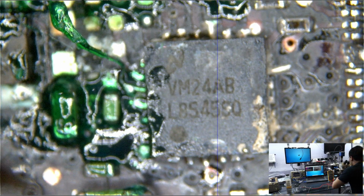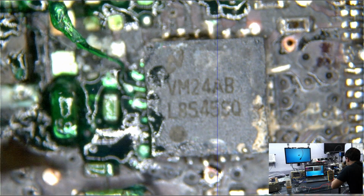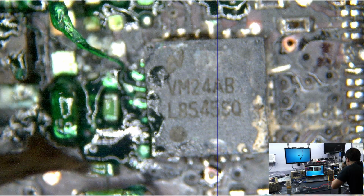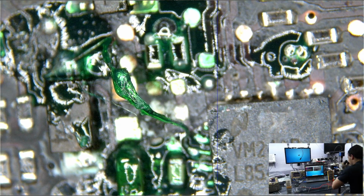That is crap. So if you use lead-free solder to solder the wire to the bottom of the chip and then leaded solder to solder the chip to the board, you stand a fair chance of that wire actually being somewhere in the vicinity of the solder pad that you intended it to be at. And that's a good thing. So that's pretty much that, and I turned it on and I got a backlight. But looking at that, I truly do not expect you to believe me.